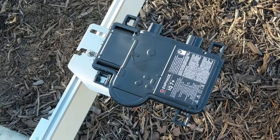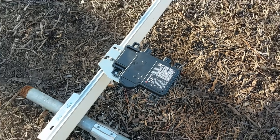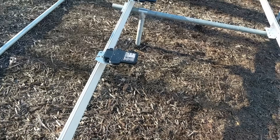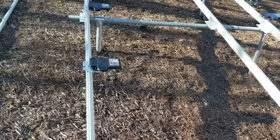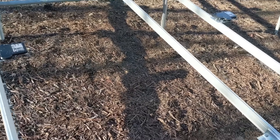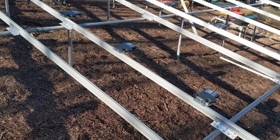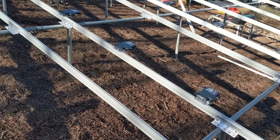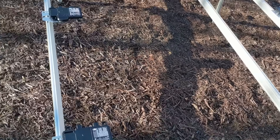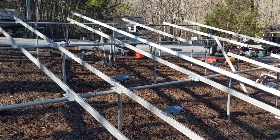It's just a grid tie, no batteries here — just a very efficient, good quality inverter. In terms of shading efficiencies, because we do have some shading here, the panels are individually managed. The power is converted from DC to AC on each panel, so they're not affected by each other. Shade on one panel will not affect the shade on another — that's another good reason to use Enphase. And Enphase has some cool stuff coming with their batteries. I don't think there's going to be a battery on this — maybe next year. So he'll be set up for it. That's another reason you can start off with grid tie, make it work with your budget, and then add batteries later if you'd like.